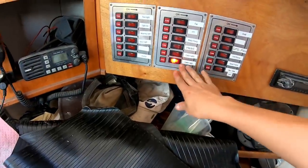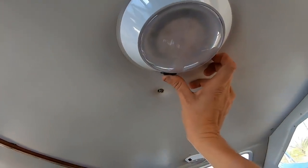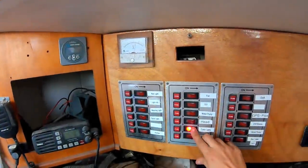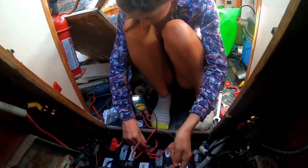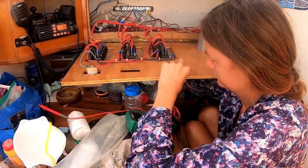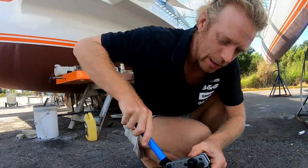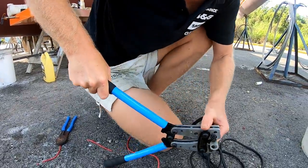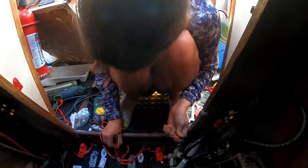Moment of truth. Oh wait, I bet that's the wrong cabin lights. There we go. Okay, good — yay, we have electricity! With all the wiring connected, we ran some tests with the volt meter to identify any current leaks, and we did find two. One was easily fixed with a new wire, very kindly provided by Andreas and Sailing Less Plastic, who has all the tools to do such things. The other was an antenna up the mast, which we will fix in the water.